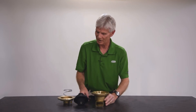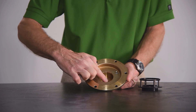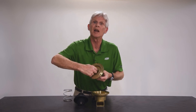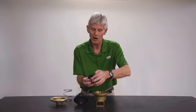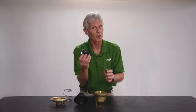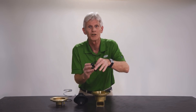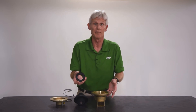Let's go through those two things again. We want to inspect the cover inside where the o-ring slides: if it's pitted we replace the cover, but if it just has a coating of patina we can clean it up with fine emery cloth. For the relief valve seat, take your fingernail and feel that seat profile: if it's chipped we replace the seat, but if it's just a light ding we can gently sharpen it with emery cloth so it bites into the rubber, giving a good effective seal and allowing the relief valve to test correctly.